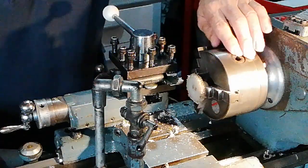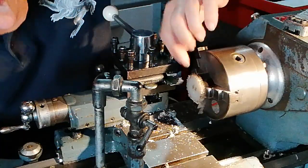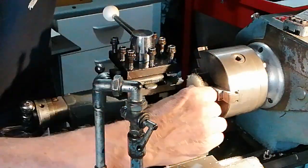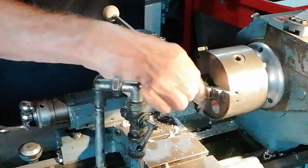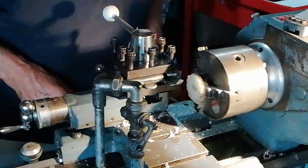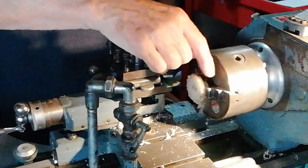Now then, I don't really see the difference, but I can tell you, since I sharpened that tool, it has made a nice smooth surface on there. Right, so I'm happy with that, even though there's oil marks there, but I think it's ingrained. This thing, I've had it for years. It's done a lot of hammering. So what I'm going to try to do now is smooth this edge off here, which can be a little bit delicate. So let's see what we can do here. Got to be careful not to run into the chuck.